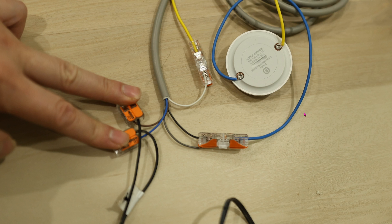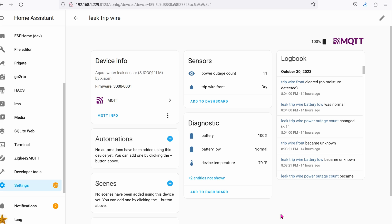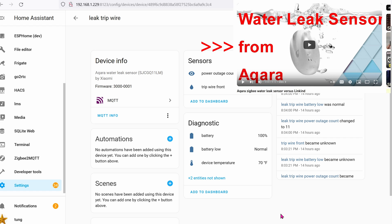If you want to do it quick and easy, use the Aqara water leak sensor. I don't personally like this sensor for detecting actual water leaks because it doesn't have a speaker, so you can't hear anything from it — if there's a water leak and your hub is down, you won't know. But it's cheap and perfect for our purposes. I wired two wires to this water leak sensor — the white wire and the black wire. When somebody walks through and breaks the beam, the sensor sends data to the water leak sensor via these two pins, which then sends an alert to Home Assistant. Unfortunately, when walking really fast past the sensor, the Aqara refuses to acknowledge the signal — it's so fast that it just ignores it. If you're standing in front of the sensor for a long time, then the Aqara will acknowledge that the beam has been broken. If you need a refresher on how to get this Aqara water leak sensor into Home Assistant, please refer to this video.